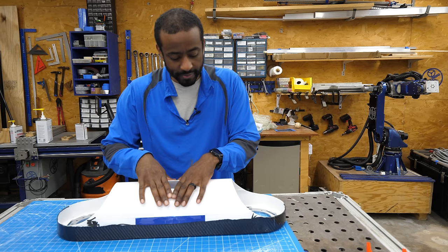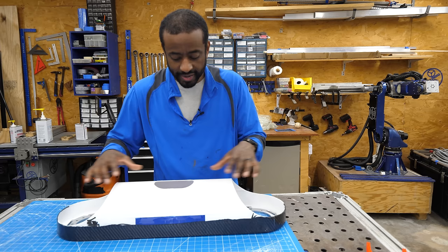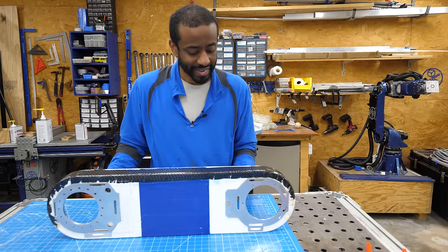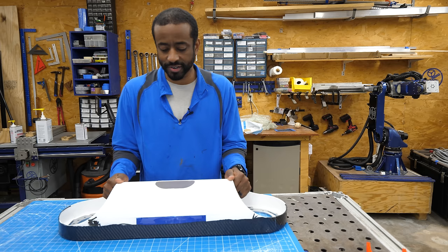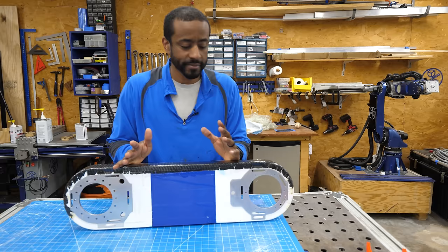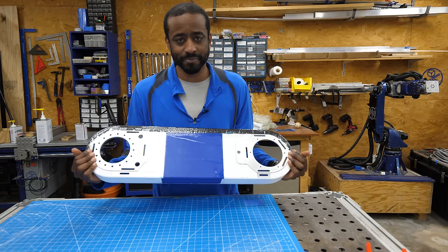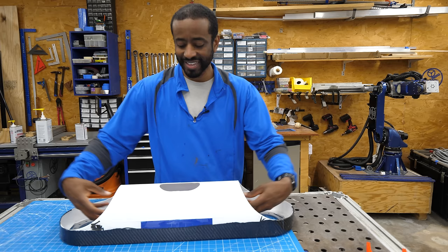It would have been much better to not have this top section on — I could have pushed the bag into all of the corners with just one vacuum bag. I could have wrapped this partially in carbon fiber and then wrapped the two pieces together, gluing the top on later. I don't want to rush this and end up with something I don't want to actually put on a robot. Let's wrap something else with carbon fiber just so we can have a finished product — the real goal of this video is just to say, go try carbon fiber. I chose something really hard.